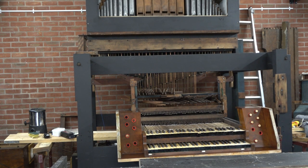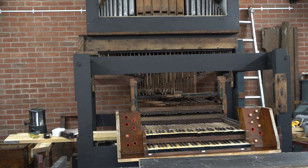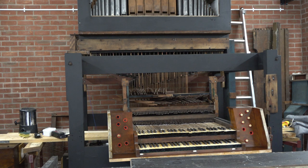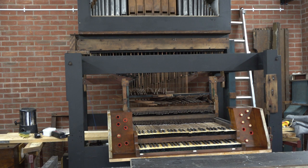We've got to the stage where all the trackers for the swell are done. The first 25-26 notes have the red felt fitted on the center pins of the keyboard, but we're still waiting for the rest to come. So the touch isn't set any further - it's pointless going to all that trouble. There's a key drop to middle F and the bushings have come out of the roller board. When putting the trackers in, the wires can poke out the white of the bushings - I've even lost two new bushings. Once it's in, everything will stay put, but during assembly you can knock some bits out, so we've got another bushing to do.